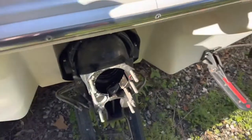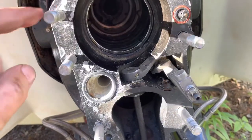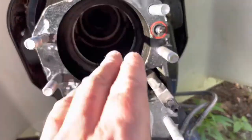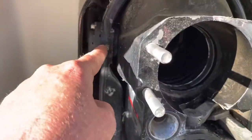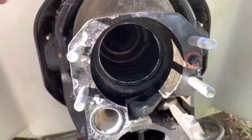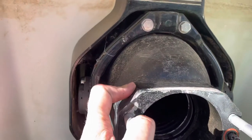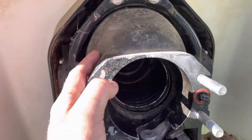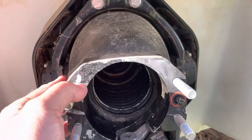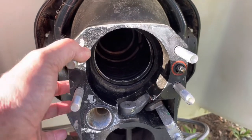There are other tools you can use to take a gimbal bearing out — there are plates that mount here with holes that miss the various bolts and push against this as they're pulling the bearing out. But when you push against this, what you're really pushing against is these pins here, and those pins transfer force to this ring — the gimbal ring around your gimbal housing. I believe it's made of aluminum, and I don't want to put that much force on it. The slide hammer method only puts force on the bearing and the transom — you're pulling against the inside transom plate — so I think that's a better way to do it. That's how I remove gimbal bearings.